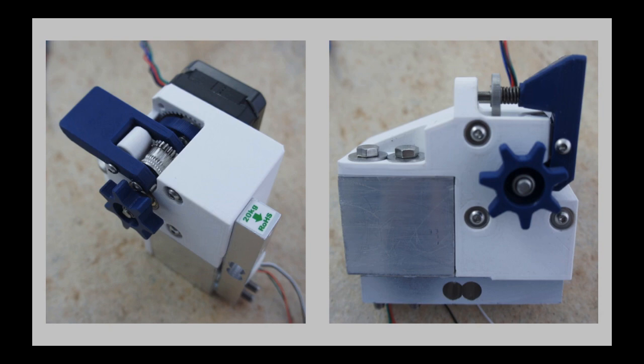During the experiment, there's one parameter that was changed physically and not just in the firmware, and that was the so-called spring tension. The spring tension I measured in millimeters, so 1, 2, 3, 4, 5. And that means basically the distance between the extruder main body and this knurled nut right here. So the greater the number is, the more the spring was tensioned and the more force was transferred onto the hob gears, which then transfers that pushing force onto the filament.